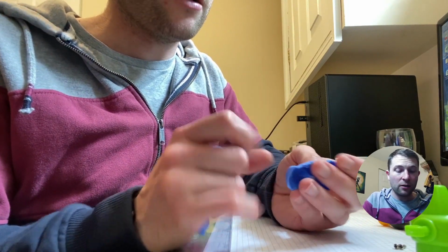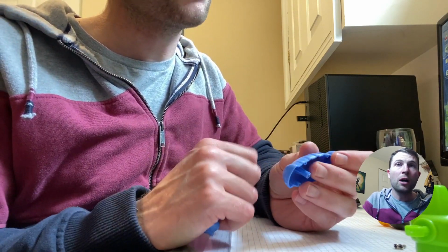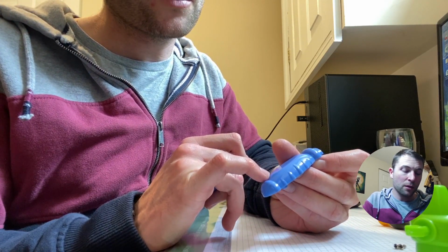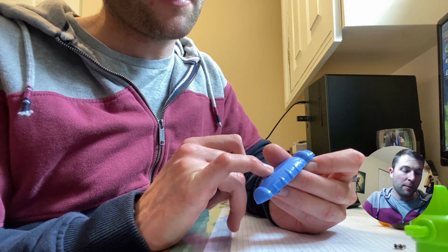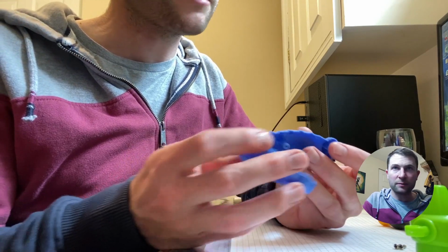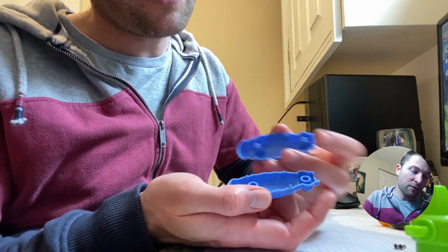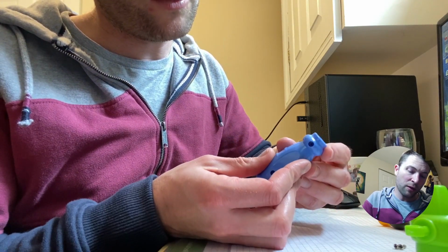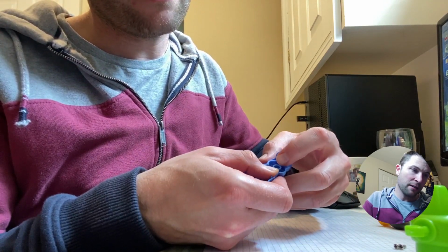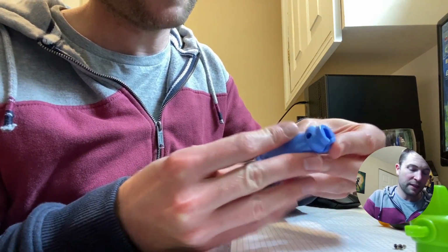You get sink when you've got thick sections of material on the part, and it could lead to dimples and surface imperfection. I think there's some examples on the next part, so we'll have a look at that in a minute. And something else quite nice, they've got male, female also on the screw bosses. So this outer diameter here fits in this diameter here, so when they go together, it fits nicely together.